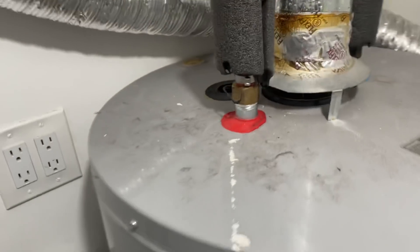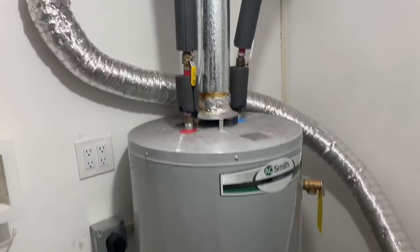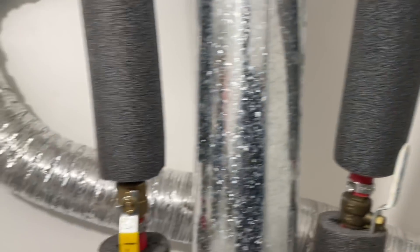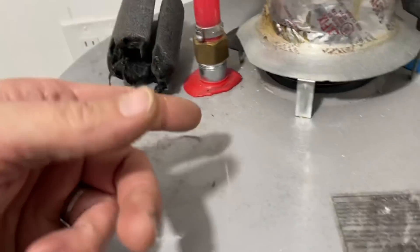The dryer vent is tied into the exhaust of the water heater, so when it comes on all the carbon monoxide comes out on top of the water heater. Look — this silver four-inch flex pipe goes here and connects to that Y over there. You still can't have two four-inch lines because there's only so many BTUs and cubic footage of exhaust a pipe can handle.